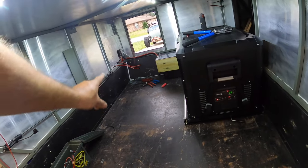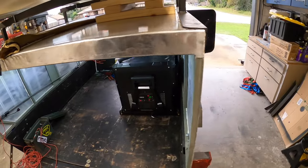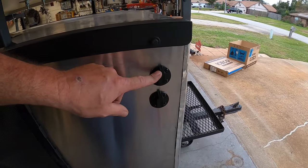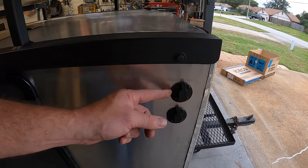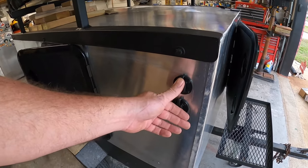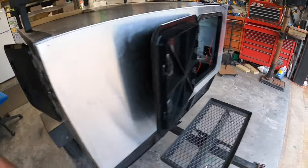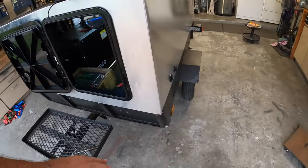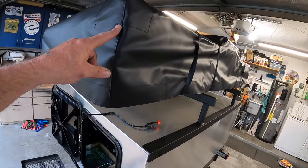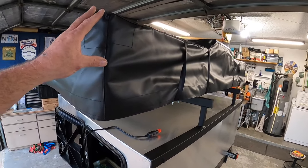Nice, very nice. Yes, I know, I got pigtails. Got a couple different sets of pigtails. These are SAE connectors. I put some butyl behind it, just like we did when we did the doors. That way I've got a way to power some 12 volt accessories outside. And I have one here that will be powering up into the tent, so I can have a light up here. I can charge accessories, phones up here, whatever, and not have to worry about running off a battery pack like I am currently, because you guys died.